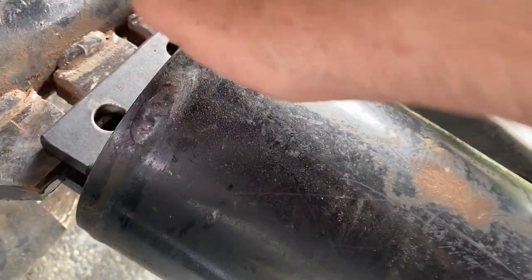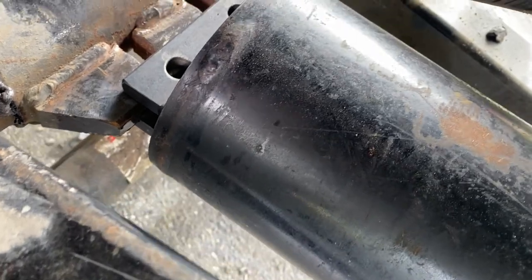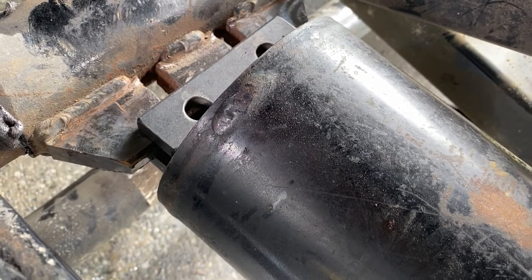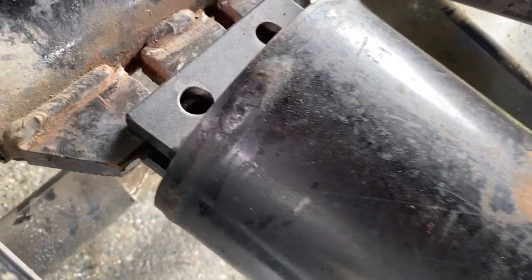We're going to put a little heat on that and see if we can't get those to open up a little bit — put a little heat right down in here on either side. Grind it off a bit on the other side, get some of the stretched metal back down to proper thickness. What a pain. Trying to manage this thing on your own — it's not very light.